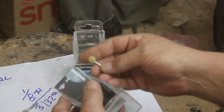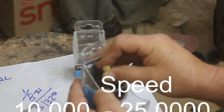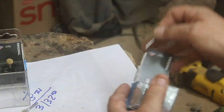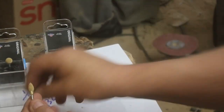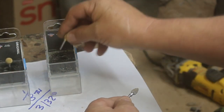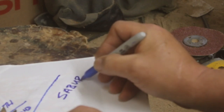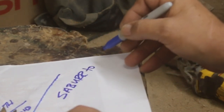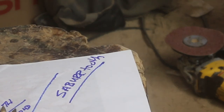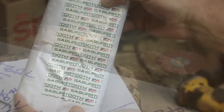The eighth-inch collets tend to hold the heavier duty burrs. Here's how Cuts-All comes — there are two unused ones here: a gold ball and a gold flame. The speed on these is 10 to 25,000, but I run nothing less than 40,000, so I'm way over the manufacturer's recommended speed. I've found that Cuts-All burrs vibrate too much in my hand, so I went to Saber-Tooth because they don't vibrate as bad and they actually seem to last a little longer — I get about a year to a year and a half out of them.